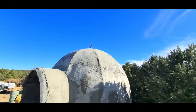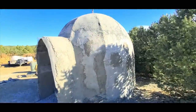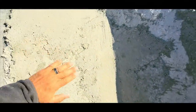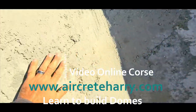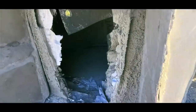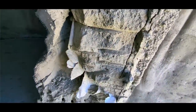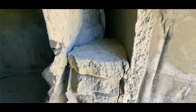This is the inner shell and that's the outer shell. I made a hole in the top — that's where we stuck a hose in to fill the cavity up with aircrete. The arches were very simple to make. Once I made the form, I took the mesh and ran it all the way over both sides and cemented it to make everything monolithic — all one piece. You can build using just cement and sand for your shell, and this aircrete made with a thickening agent is much stronger than regular aircrete.